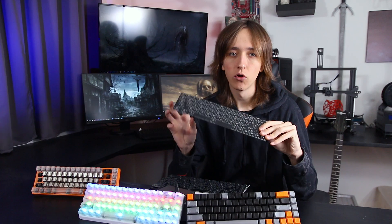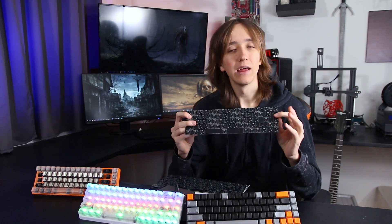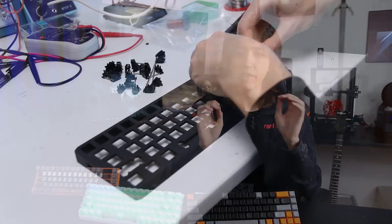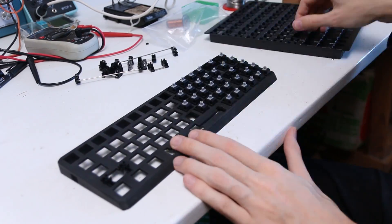The only big advantage to having the Arduino built into the board is that you only have the thickness of the board and can put the connector wherever you want. With this board, the only place the Arduino would fit was to the side, which meant the USB port would be on the left side — not really where I'd want it. So at the last minute I also put a USB-C port up in the top corner with some pads so I could connect it up. I thought maybe I could use it later, and as you'll see, that turned out to be a really good idea. But on the first version I just used the side-mounted USB port, which works fine — not ideal, but good. So I printed a shell, fitted all the keys in, and assembled the first one.